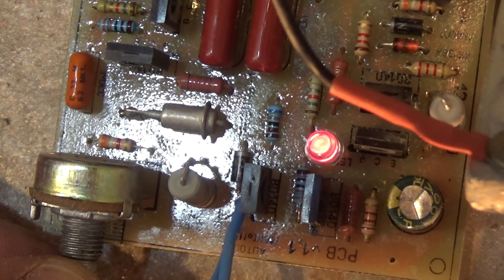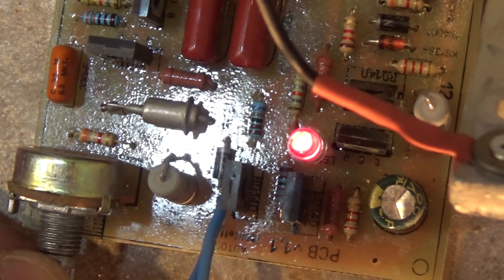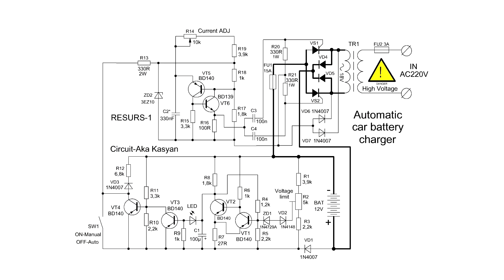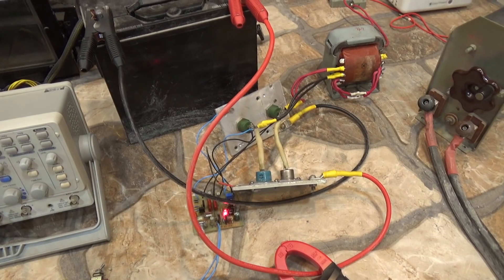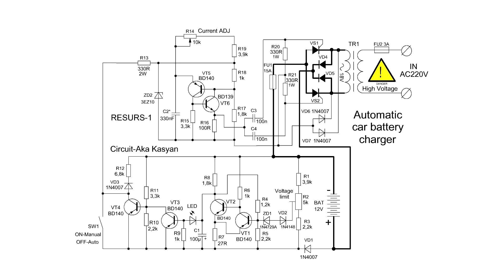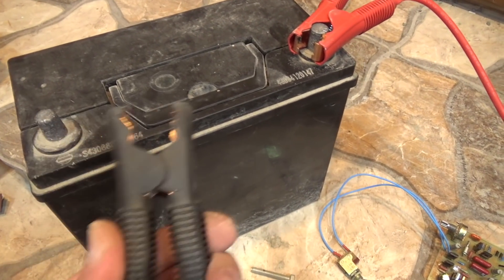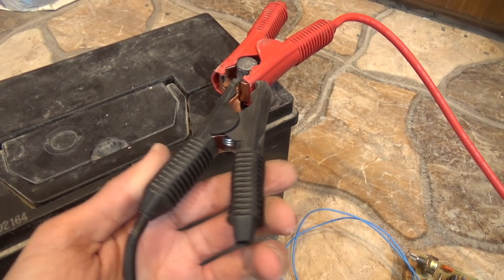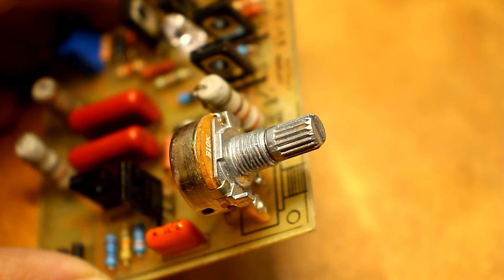In manual mode, the LED will change brightness depending on the current. In automatic mode, this LED will turn on abruptly upon the end of the charging process. With the switch open, the device operates in automatic mode. The circuit will work only when the battery is connected and will have all protections and auto-shutdown. In this mode, the control circuit is powered by the battery itself. A protective diode is installed at the input — if you reverse the polarity, it simply won't open and the control circuit won't start. This is reverse polarity protection. And for short-circuit protection: without a battery there is no voltage at the output, and no matter how you short-circuit the wires, you won't even see a spark.